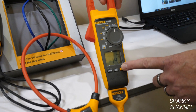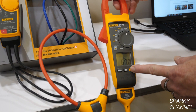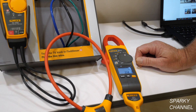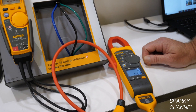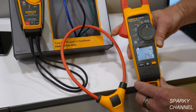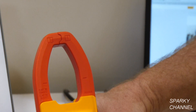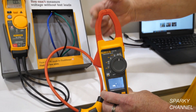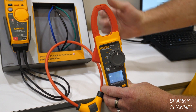The iFlex also has the capability of measuring hertz. Is the iFlex more accurate than the clamp meter? The iFlex is a little less accurate than the actual clamp meter, but we're talking between one to two percent — that may be because of the larger area and the sensitivity of the flex itself. When using the clamp jaw, we want to keep the wire in that marked line, as there's always a rejection on the core going around it — we're trying to reject any outside influence and keep the measurement right in the middle of the jaw.